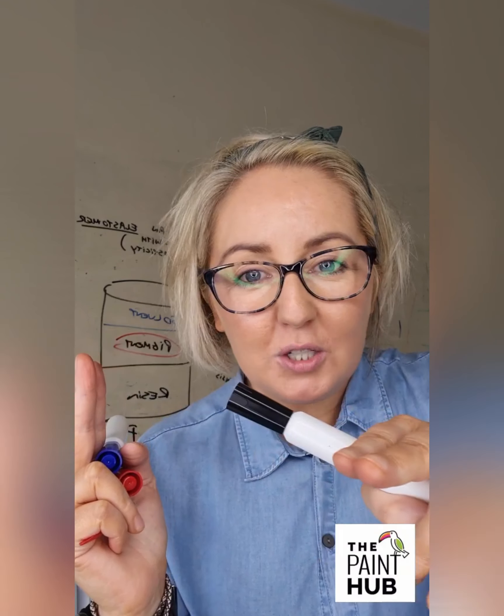One of the best properties of latex is that it's elastomeric - it has really good flexibility and durability. See here - I pop the balloon but the paint can cope with that level of flex. It hasn't cracked, it hasn't torn. Now here we have a generic brand - you can already hear it crinkling, some bits cracking. I'll scrunch this one up. Look - it can't cope at all with any flex or movement. So if you have a movement crack in your wall, you know what's going to happen to that paint - it'll start coming off.